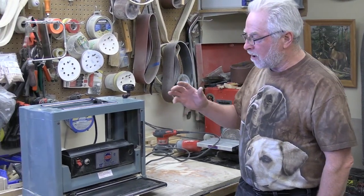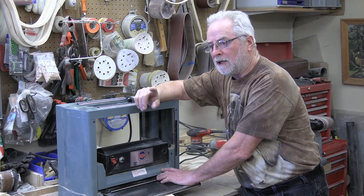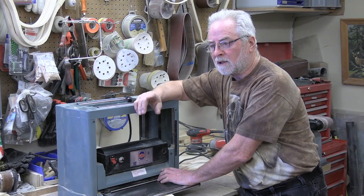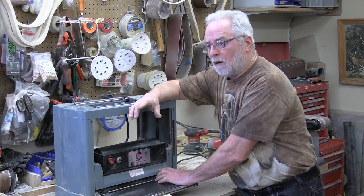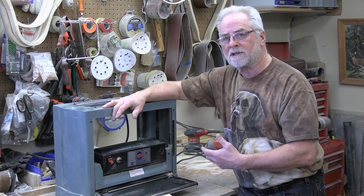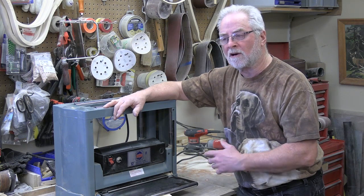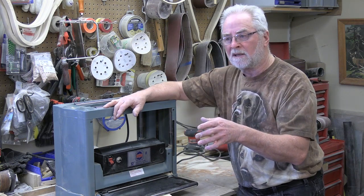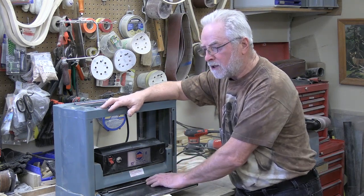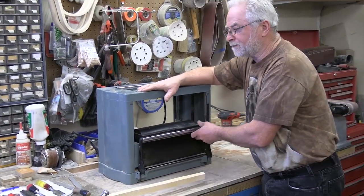For the crossbeams — not the frames — we have a 12-inch planer. If you had to make your beams by hand they'd be inconsistent in dimensioning and finish. It has to be seasoned hardwood, whether you're using local-cut birch, juniper, or oak from someone's construction waste — they're all good for beams. The older and harder the wood, the more difficult it is to work by hand. If you're doing eight or ten pairs, use the planer. We could probably run a hundred beams through it in maybe 15 minutes.